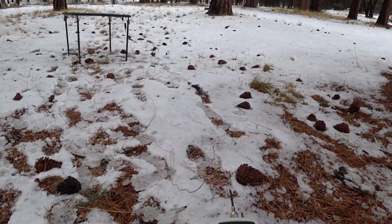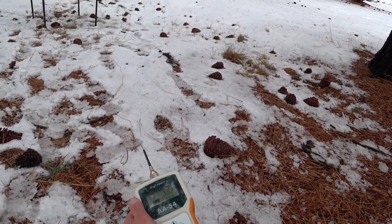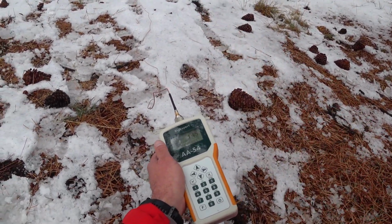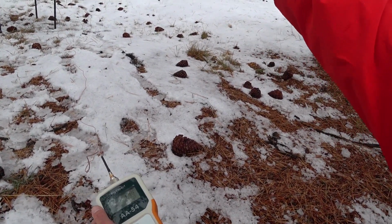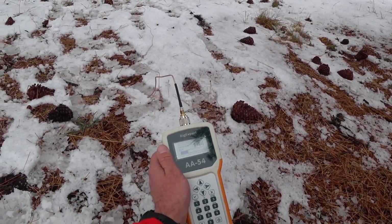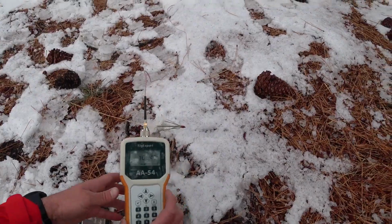So that's how easy it is to set up a random wire. Get a 9-to-1, put it up in a tree. I mean, it's literally, I should be able to find this on most mountaintops, a tree, and then run this off a trekking pole. And, you know, I could always run some rope up in the middle to a tree that's closer to, you know, get it up off the ground. But, wow, that's amazing.